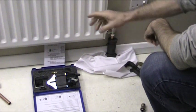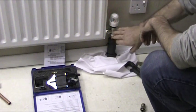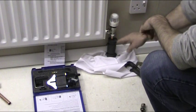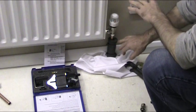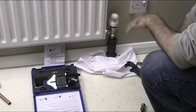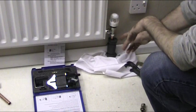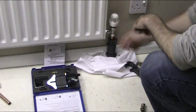Now the next thing to do is open the valve at the other end, and that will let water back into the radiator and flood the valve here. Check for any leaks. Once you're happy there are no leaks, snip off the tie wires on the freezer kit, take it off, and just leave it to thaw out in its own time — it'll probably take about half an hour. After that, there's no refilling of the system needed — you've not lost anything at all. Just put the system on, run it hot, dry around the joints, and check it's okay.